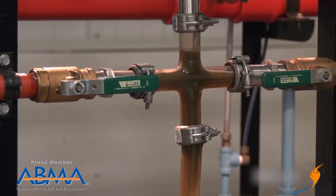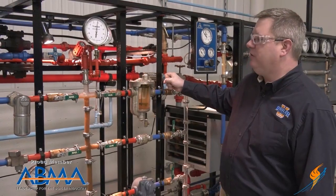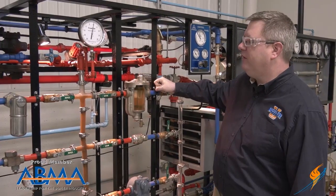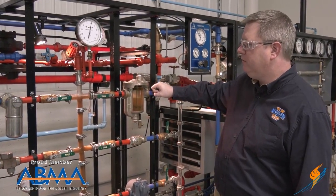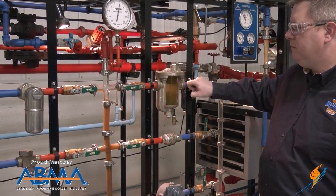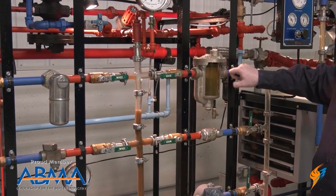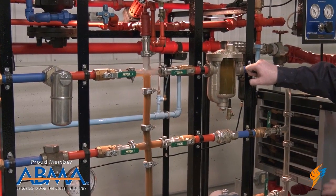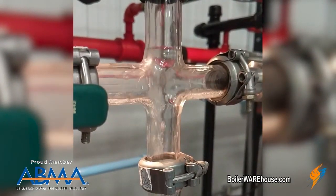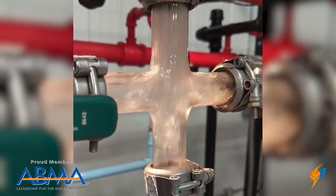What we're seeing here is the introduction of steam to this cold pipe. Anytime we allow that steam to flow into a cool area, we've got a potential for hammer. So we'll watch this as it occurs. What we're seeing here are shock waves generated by the absorption of the heat by the steam and the basic implosion of the water into that space. It's actually the water refilling the space displaced by the steam that's causing the hammer sound.